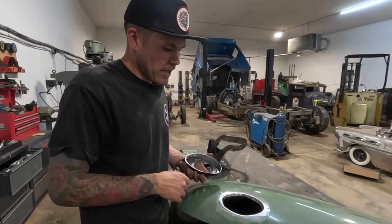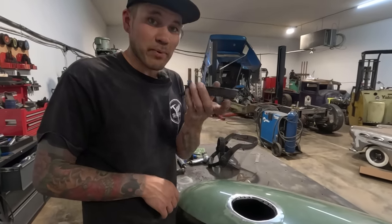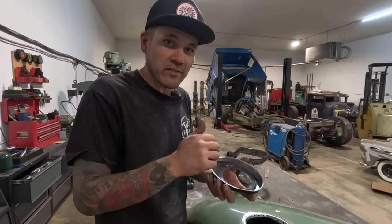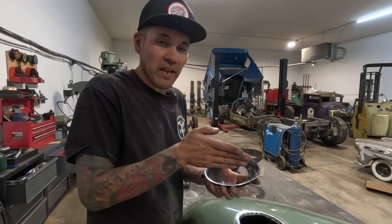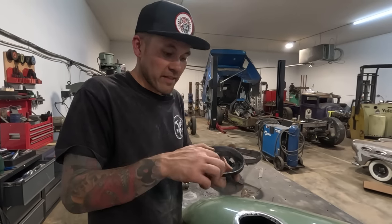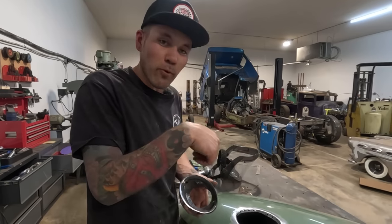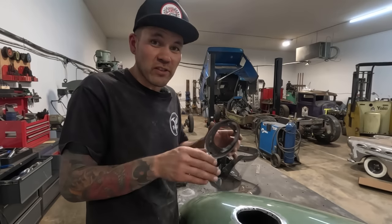of that material. And then also we're gonna tack this in place, once we get a couple of spot welds close, and then we'll actually hammer into this using this piece itself as the dolly, and we'll just keep working it. Just slowly keep working it all the way around and it'll stretch a little each time you hit it